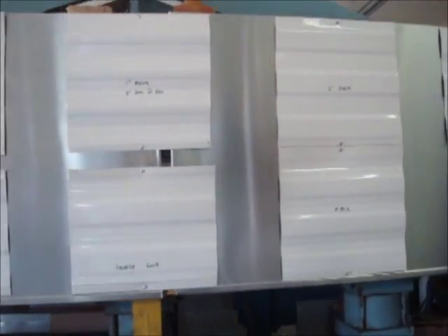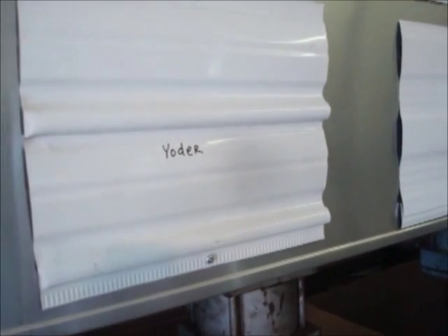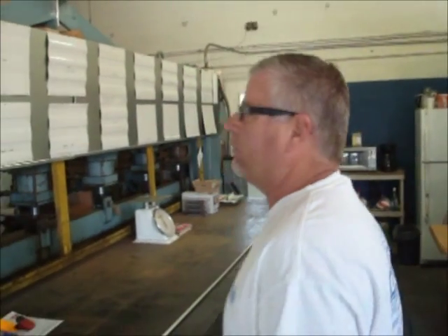You'll find those two patterns very popular back in the 70s. As things kept progressing and coaches got larger, the Yoder pattern was very popular to combat heat expansion. But as you can see, it's very roly-poly and you cannot install graphics on it very easily — it's not a smooth look. So they continued to evolve and came out with 1-inch Mesa Deluxe, which repeats every 3 inches. And the latest pattern, most popular with everybody, is the 1-inch Custom Mesa — with an upscore in the Mesa hump and three full lines in the valley, repeating every 3 inches. All major manufacturers use that pattern exclusively now because vinyl graphics have gotten so large and you need a smooth pattern to install them.